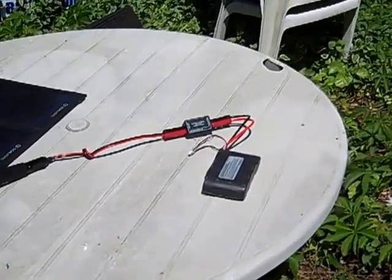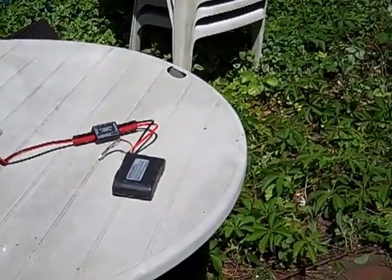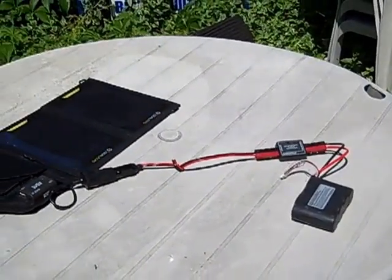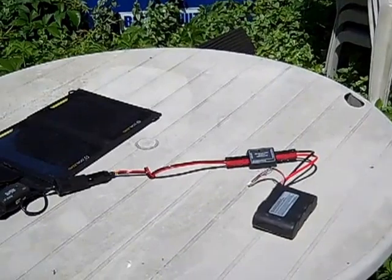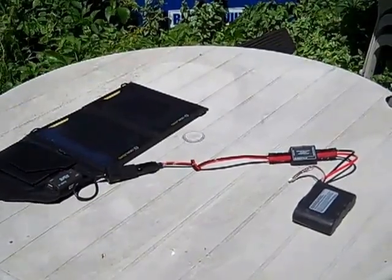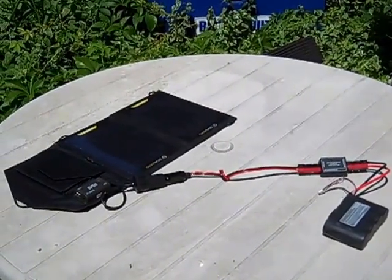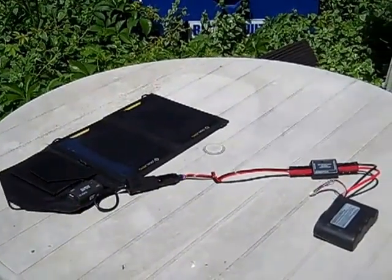Using this method will take about an hour to fill this little battery, and about an hour of operation — so if you have two, you can alternate. The big solar panel we showed first will take about 15 minutes. The other setups using the balanced approach will take whatever it takes under normal conditions, since the Cell Pro XS will charge and balance as needed — anywhere between 10 to 15 minutes, and as long as 35 to 45 minutes, depending on the current and amperage you are drawing. There's a whole toolkit of chargers for different situations: Field Day, DX, portable, and maintaining batteries on a regular basis using a balanced approach.